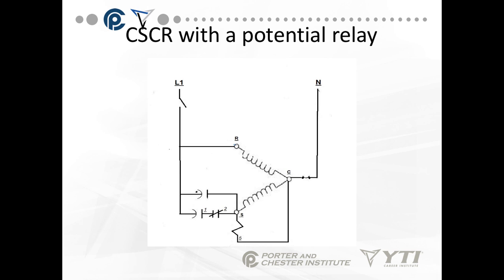In this presentation we have talked about the four motor types: split-phase, PSC, CSIR, and CSCR. With each comes an incremental increase in torque handling and running efficiency. We also touched on the hermetic motor and how to measure resistance to identify the windings: R to S is your highest resistance, C to S is next, and C to R is the lowest.